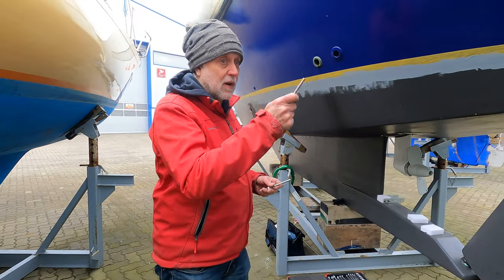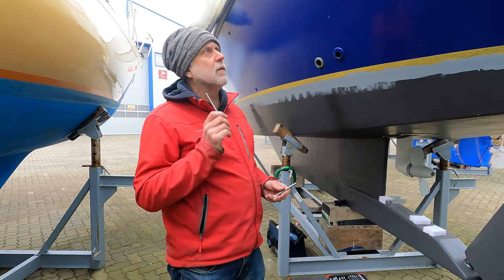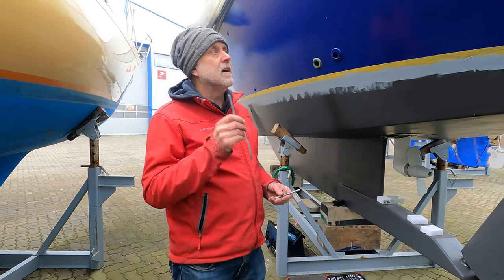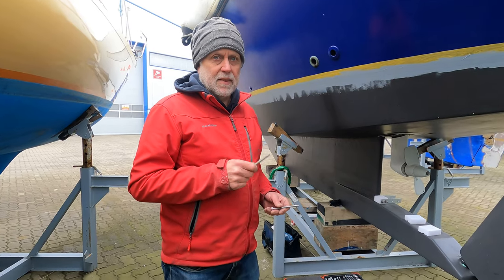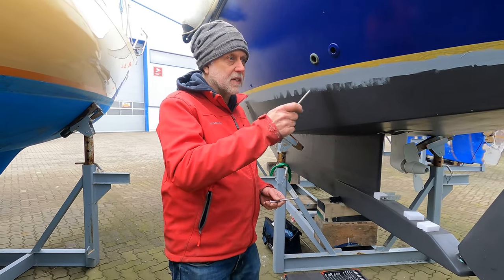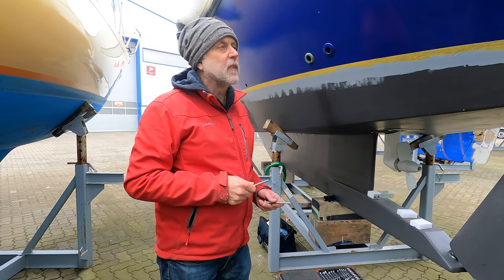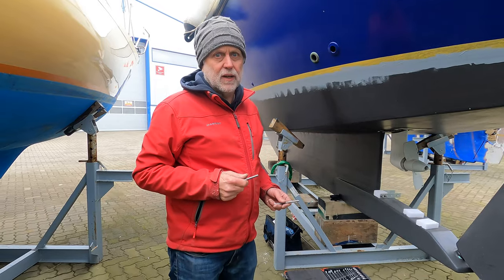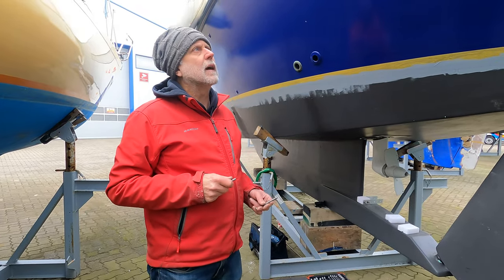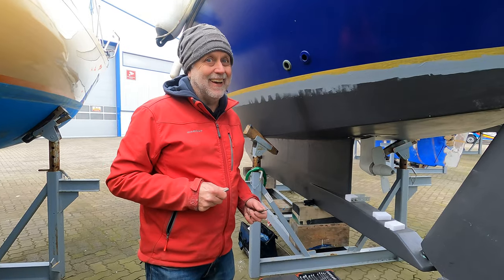We've drilled the rudder for the upper bearing for the trim tab. Now I'm going to bolt it on temporarily, then I can drill a lower one. And then we can measure the distance that this needs extending so that it clears the top of the tiller. Then we can take it all off again, drill and fill those holes. And that'll be it for today. Come back tomorrow quite likely, redrill, and actually fit it!